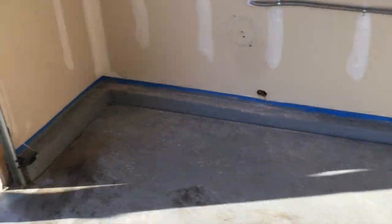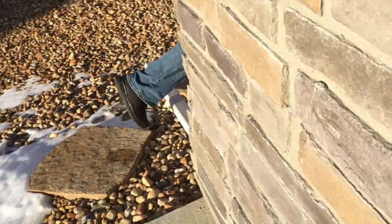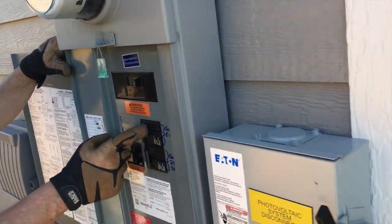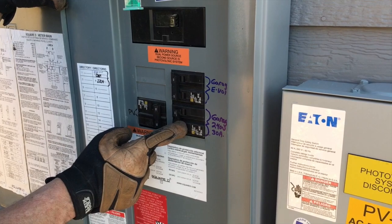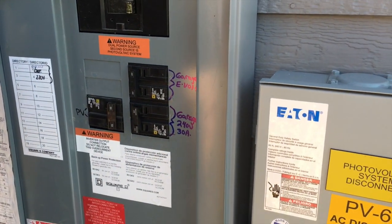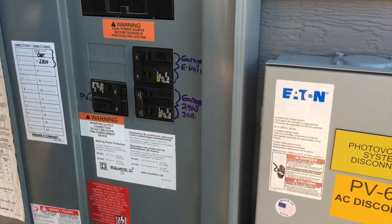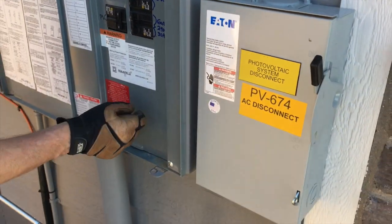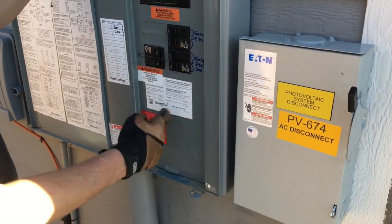We have the EVOLT car at 60 amps right here, and then right here for his cryptocurrency — I'm not going to label that, it's just typically a garage plug at 30 amps. We drilled right through the back of the panel — I don't need to open that up, but it has a little fitting with the flex on the back with the seal.